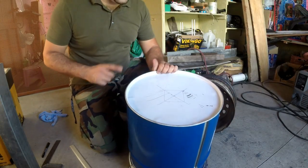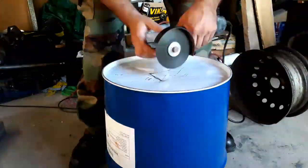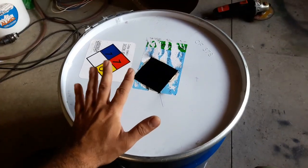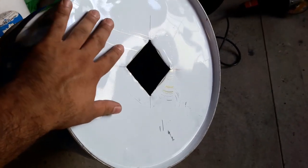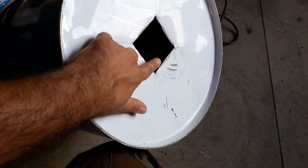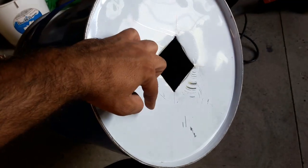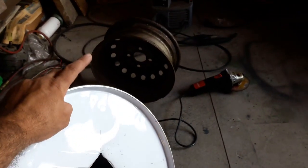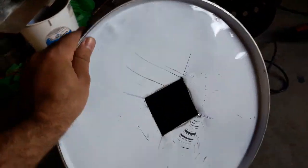Now I have both sides of the drum marked with the square lines where the pipe will go through. Both sides now have the hole — the lid and the bottom. I'm going to put the pipe through both holes and only on this side will it be welded. It has to be a very good weld here to avoid the gases of the wood burning on the inside escaping through this side. When this is working it will go upside down — the lid will go on the bottom to the fire and this will work like a chimney in the center. That will transfer the heat from the rim where the fire burns to the inside of the whole drum, making the wood convert into charcoal.